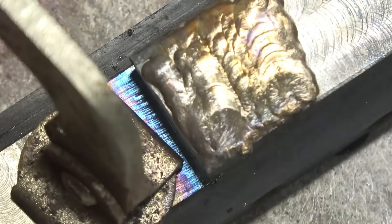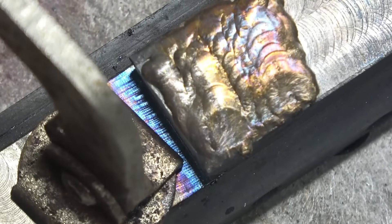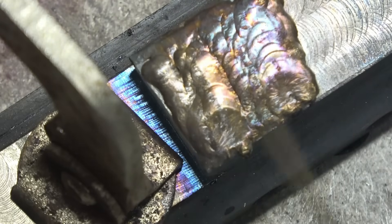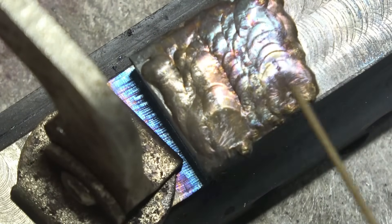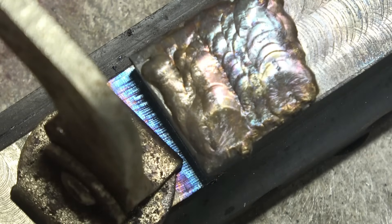So it's built up, laid the bronze on quite nicely — you'll be able to fly-cut that now and get it to fit. That's the silicon bronze wire they use. It's used a lot — it's the modern equivalent of brazing. High-end bike frames, the go-kart frames, are all silicon bronze together. Looks really nice when it's done properly.